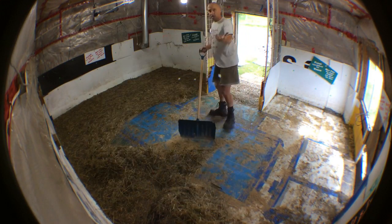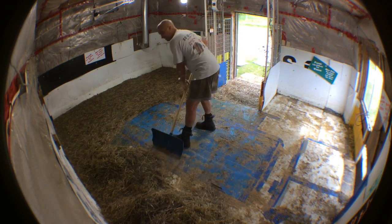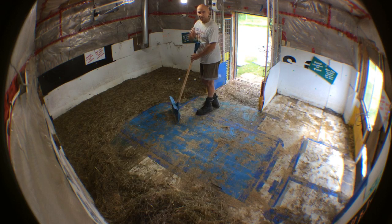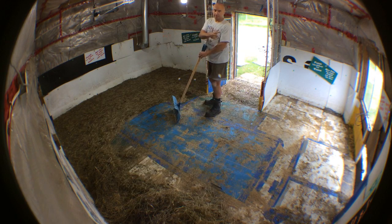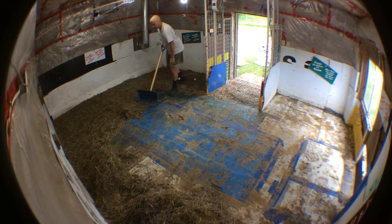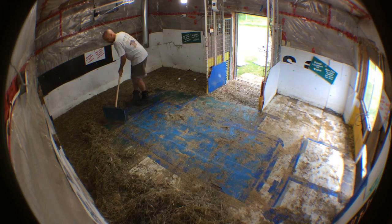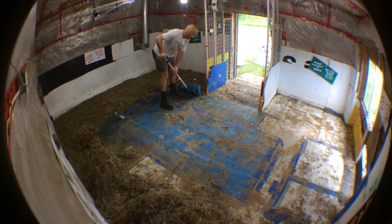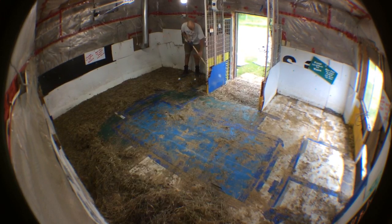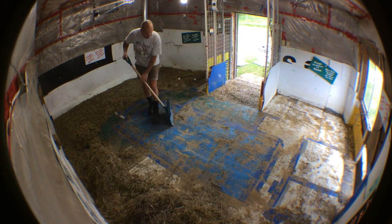So the problem was, even though I had cut it off and got rid of the bind, and I took my Dremel and my sander and made it nice and smooth inside so nothing could bind, it didn't matter. The spring wasn't strong enough to push the shells out, bottom line. I don't know how you could have a tube that's 5 inches longer but only needed a spring 2 inches longer. I was in the garage and laid them out on the bench, and they looked like the same size. Sure enough, only 2 inches different. So no matter what I did to it, there's no way I could have fixed it.